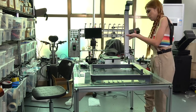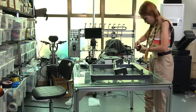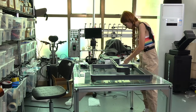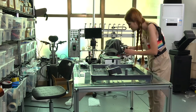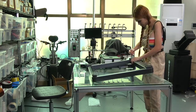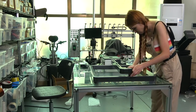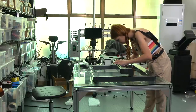I've seen some signs of progress that makes me inclined to give this one a try, particularly because right now I have a specific need for something a lot smaller and a lot cheaper than my large CO2 laser cutter you've seen me use in the past. The Mr. Carve M3 has two different laser heads. Blue and infrared, which you use depends on what you are cutting or engraving. The infrared is used for engraving metals. It can cut material up to 8 mm thick, which is more than enough for my needs today.